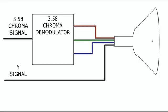The picture tube has four inputs: one for red, one for green, one for blue, and one for black and white. If you get a signal at the red input, the screen glows red. If you get a signal at the red and green inputs, the screen glows yellow. If you get a signal at the red and blue inputs, the screen glows magenta. If the picture tube gets a signal in the fourth input only, the screen glows white or gray.